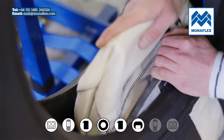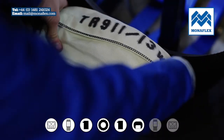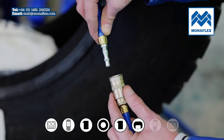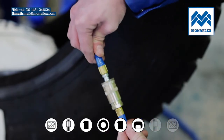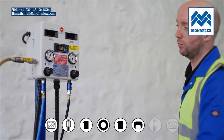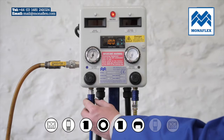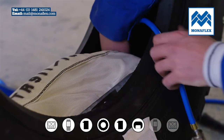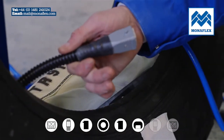Place the cylinder air bag centrally behind the inside heat pad. The blue elasticated window should be positioned facing the sidewall on the repair side. Connect the blue air line to the cylinder air bag hose. Switch the incoming air tap to on and partially inflate the cylinder bag by pulling down the slide valve connected to the blue air line. When the cylinder air bag is taking shape, stop the air supply and check the positioning of the bag. The annotated name of the cylinder air bag should be visible on the cover between the beads.